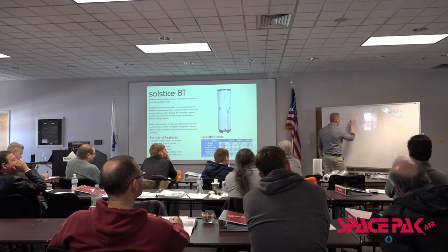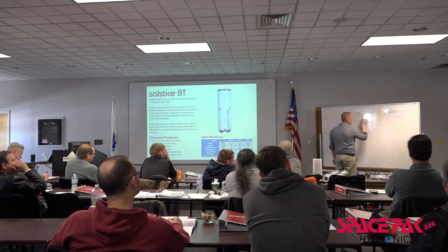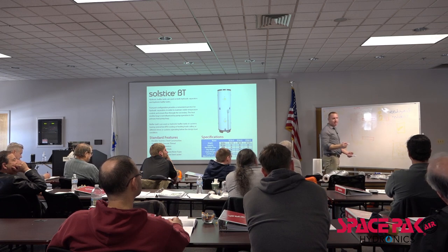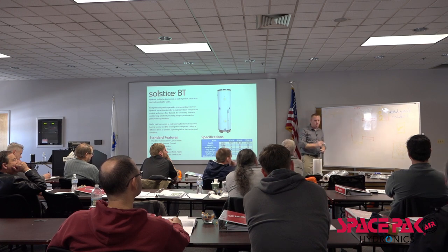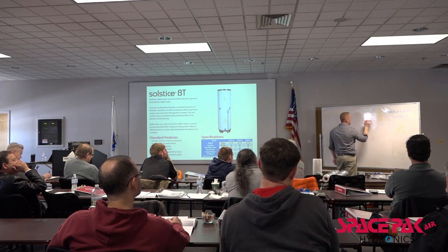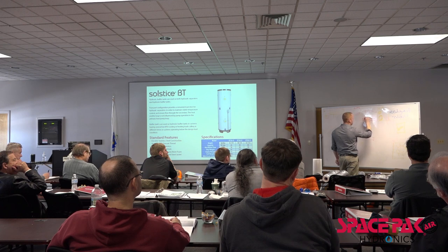We've got in and out. It's an open buffer tank. So here comes our manifold, this is coming out. It's going to be copper. The tappings on the 26 and 40 are 1.5 inch stainless steel, and the tappings on the 80 gallon are 2 inch. So here's our inlet, going this way. We pipe out of this, so here's our unit. We come in, this is going to be our return, and we come back over and go into the unit there.